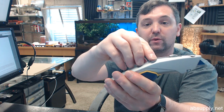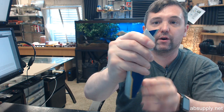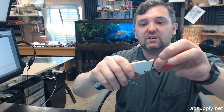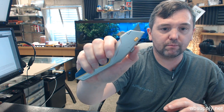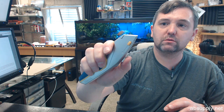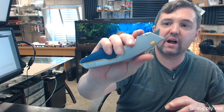It will only go in this far because this is not retracted all the way. Trigger is depressed — slide it in until it basically stops. Tug on it and make sure that it's clicked in, and it is in this case. You can then operate it normally. There are multiple points to set it; if you're just going to score something you want it real shallow blade presence like that.